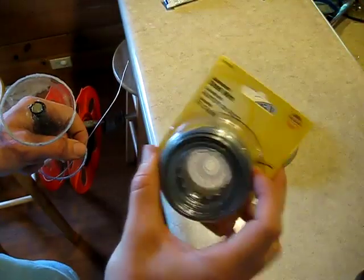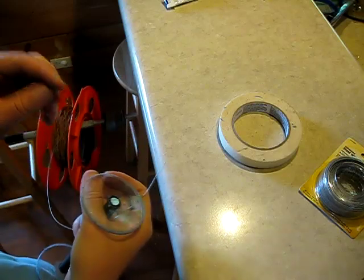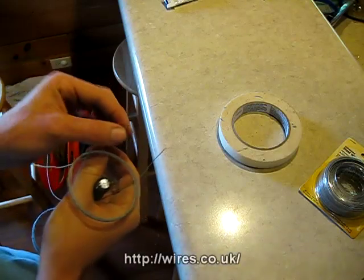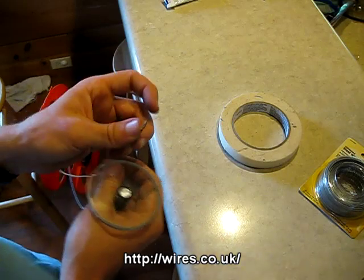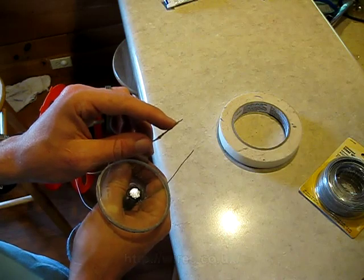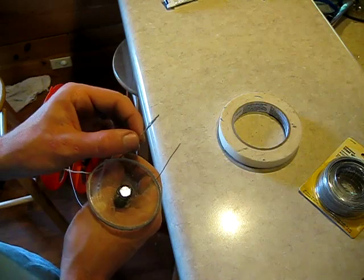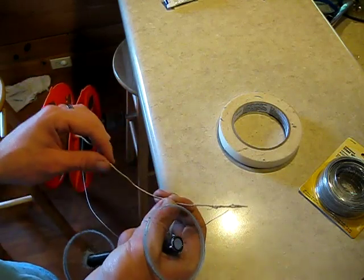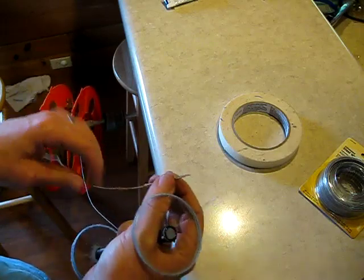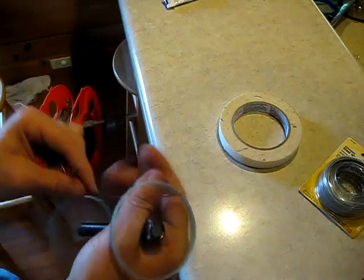For my iron wire I'm going to use 20 gauge galvanized steel wire from Lowe's — easy to come by. The cotton-covered copper wire is a lot harder to find. I'll provide the link I've been ordering from — I've been ordering it from overseas. I'm using 0.9 mm copper wire with a cotton covering, 125 grams per roll. I've got about five rolls combined into this large spool. This wire is a little dirty — I've used it in some previous coils and had to take it apart for a how-to video.